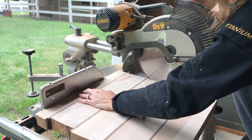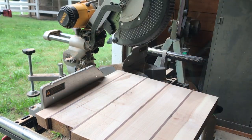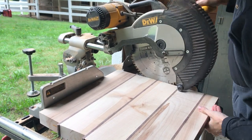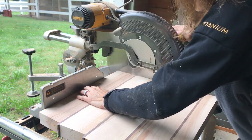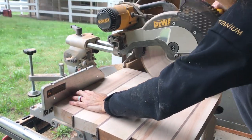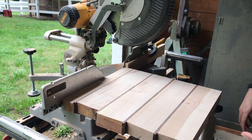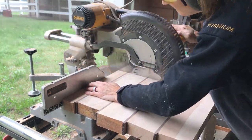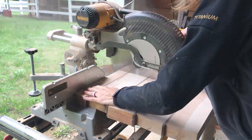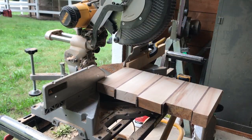At this point I had a cutting board, but to give it the brick pattern I had to cut it again. Since my goal was an end-grain cutting board, I cut it at the thickness I wanted plus a little for sanding. I cut seven strips at two and one-eighth inches — I wanted to end with a two-inch thickness. Since the bricks had a chunky solid look, I thought it wouldn't look right if my cutting board was pretty thin. That extra one-eighth inch will give me just enough for sanding any unevenness in the glue-up to make sure I end up with two inches.